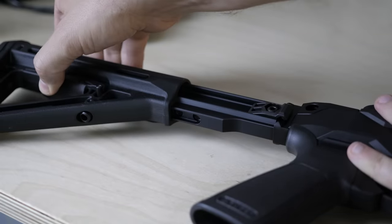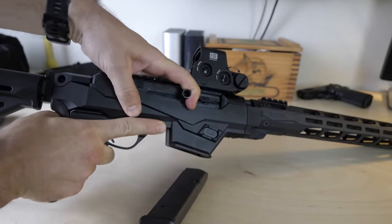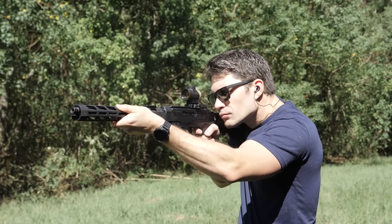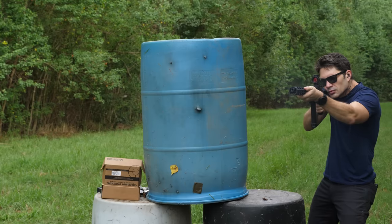The recoil assembly is contained fully within the receiver, which is great because it means you can have a folding stock — but notice I said you can, because you don't get one from the factory. It would have been nice if they just put a little hinge on here for a folder right out of the box. This is a straight blowback gun, like an Uzi — not sexy like the MP5 or the MPX. It doesn't have an exotic, sophisticated operating system. When you pull the trigger and the round detonates, all it's doing is pushing the bolt back. Nothing delays the blowback other than the weight of the bolt itself, which typically translates to more recoil versus shooting something like an MPX or MP5.